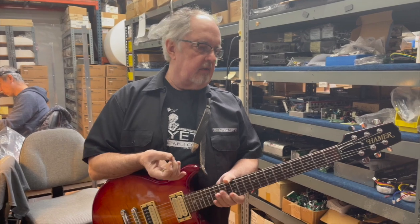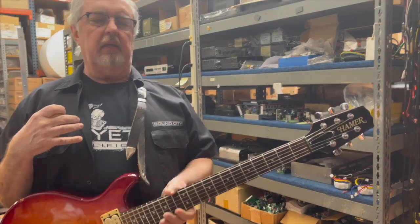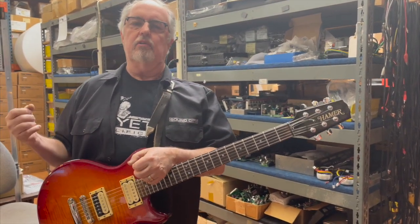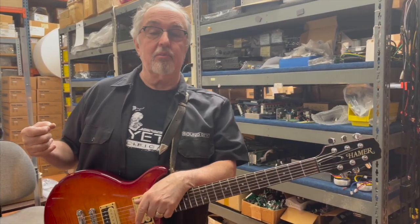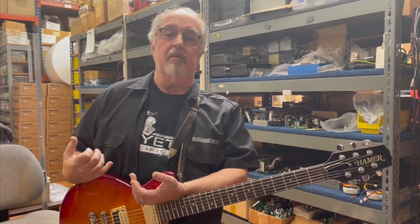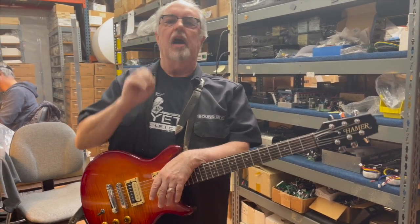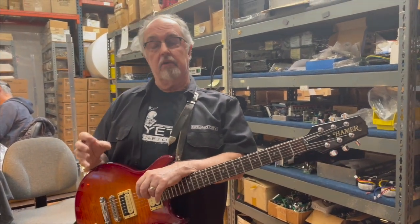So what I was doing there was inducing the ghost notes. And the one thing that you can really get out of an amp like this set to a right-hand sweep into an attenuator that you can't do as well variacing it down is induce the ghost notes, because that's a power supply function. The power supply has to be under full load in order to accomplish that. And if you variac everything down, you're running the amp at 18 watts, you're not putting any load on the power supply, you're not saturating the output transformer, so you're not going to get that ghost note activity.